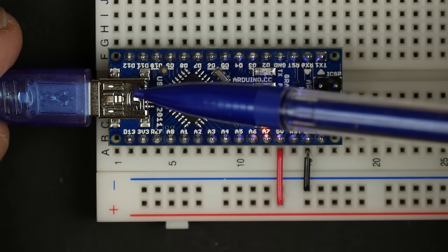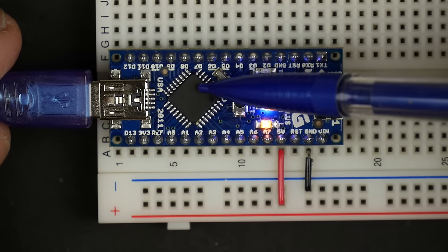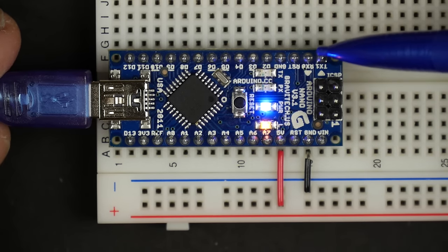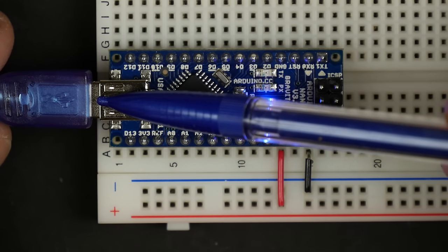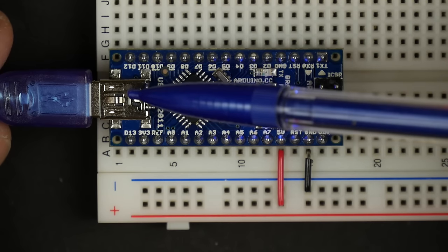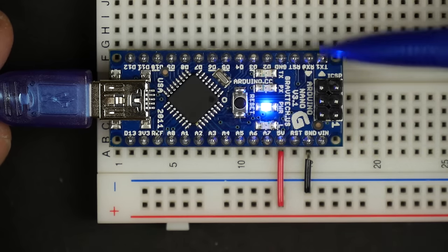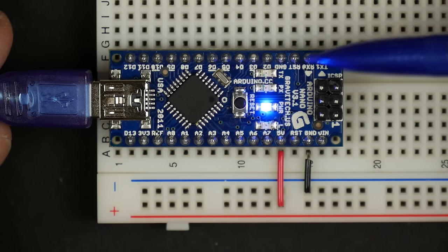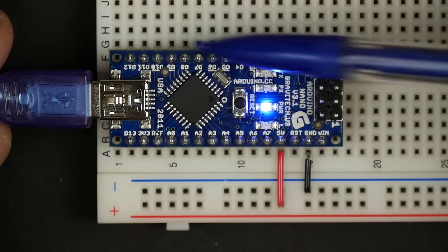And as you'll see, we really want to use that serial interface, because if we want to read what's on the EEPROM, it'd be nice to be able to read the data from the EEPROM and then send it to the computer so we can display it on our screen or something so it's easy to read. And to do that, we need to use the serial interface through this USB, and that takes up these first two pins. So instead of 14, that leaves us with only 12 data pins to work with.